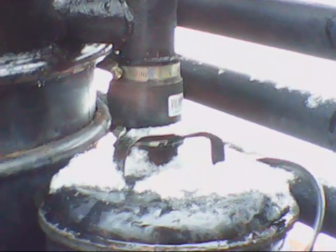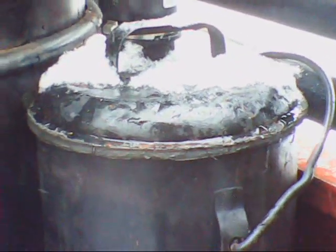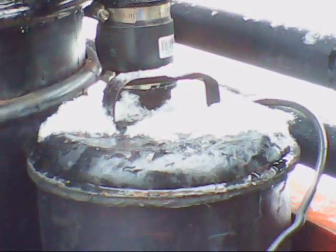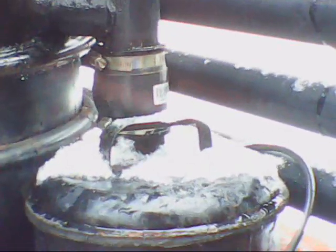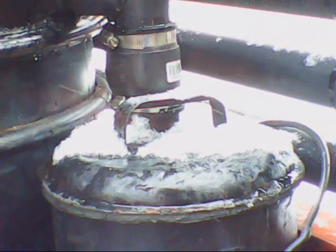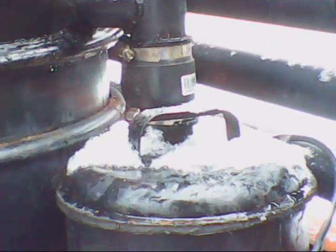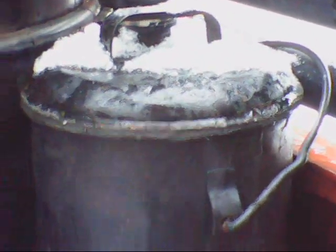The inlet is that two-inch pipe there, coupled to the rail. That's also how I drain it - I take that rubber coupling off, unscrew it, and just dump it. It's been working really well, especially in winter. The condensate doesn't freeze, and the tar will actually stay liquid or at a high enough viscosity to pour out of that two-inch opening if I run the gasifier long enough. This is sealed with silicone so it has a good seal. I haven't needed to open it up.